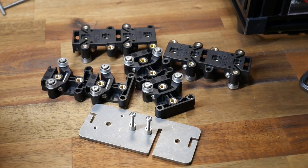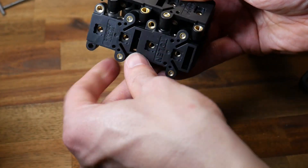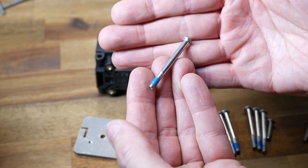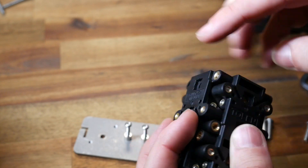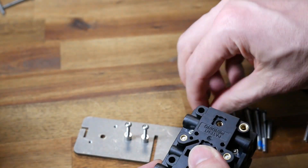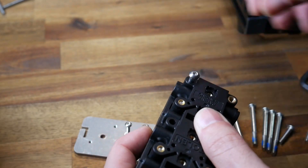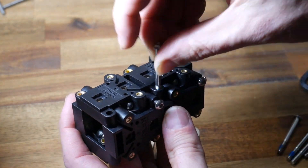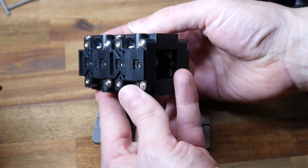We can now take four ExoSlide pieces and rotate them as necessary to build up an assembly that completely surrounds a 2020 extrusion piece. Locate from the kit the set of eight long bolts that have blue Loctite on the ends. You'll notice some threaded inserts with vacant holes on the opposite sides. Insert the long bolts through these and tighten them with your hex key — there are two per side, so after each one rotate 90 degrees, find the empty holes, and repeat the tightening process.